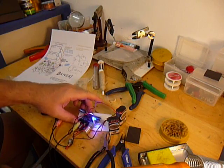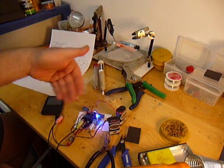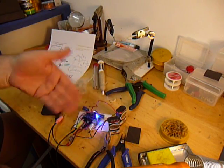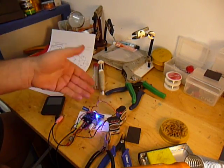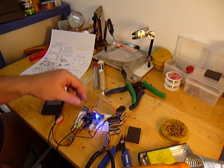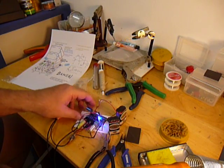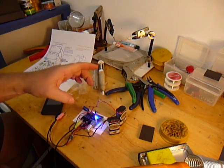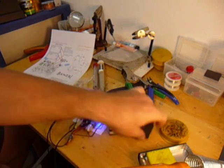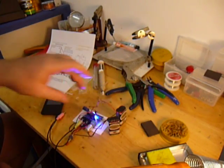You want to make sure that you set this down on a surface that's clean and doesn't have any wires or any conductivity. Since you've been working and you've got loose wires around, you don't want to set the amp down on that because it can short on the backside. Make sure when you power up you've got it on a piece of foam or paper or some non-conductive surface. You definitely don't want to drop it into a tin like this — make sure you use some EVA foam or something to insulate the board from the can.